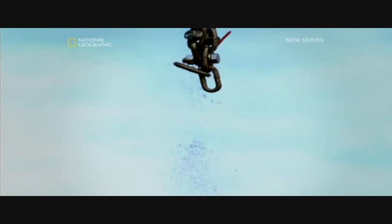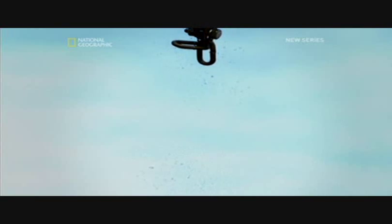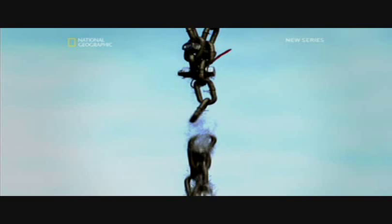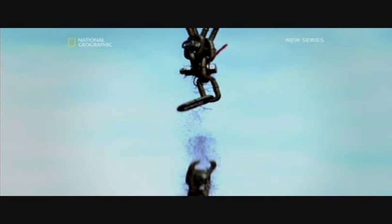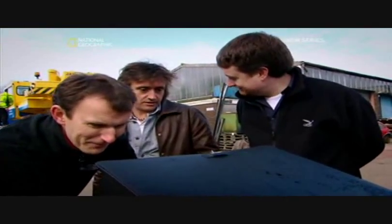Just like in the mines, the chain takes a much greater load than rope, but it breaks catastrophically and without any warning. That's exactly where the two links cross over — it's the shearing, where it's bending round. We were recording at 2,000 frames per second, so that broke in less than 5 milliseconds. You'd have no warning at all. Instant.